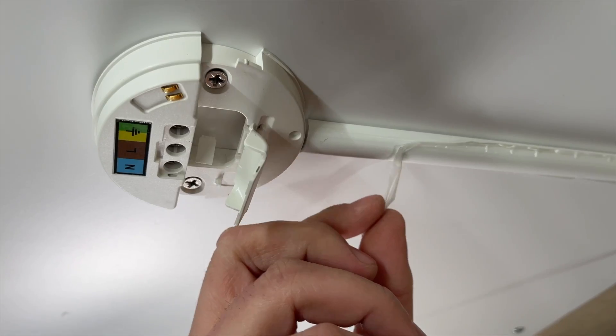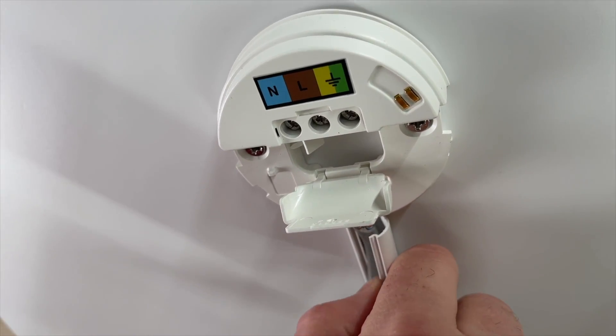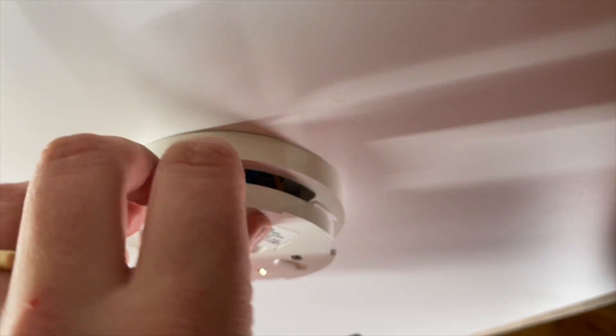There are a few different wiring options. You can surface mount the wiring and bring the cable through the side using mini trunking — we've paired that with miniature D-line trunking to keep the minimal aesthetic — but in most installations you'll be wiring from behind the unit. Note there's a slight difference in terminal configuration between the heat detector and the smoke alarm, and terminals going against the ceiling will have people reaching for the wiring regulations. That falls under Wiring Regulation 526.5, where the building itself can form part of a junction box if it is a non-flammable surface. For a wooden ceiling, you'd need to add a conduit box behind the fitting.